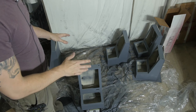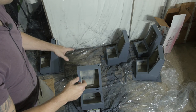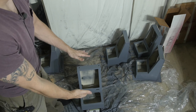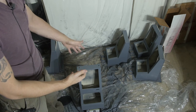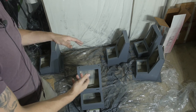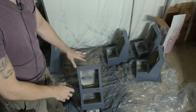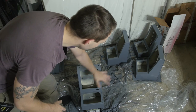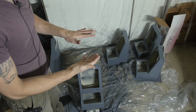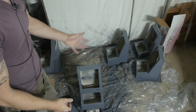And the process that I want to go about doing is basically the same as the primer, except that I think I'm going to start, like we did before, doing this whole midsection, basically the majority of it, and then flip it on its side after about an hour, and then do the top and the bottom. And then when we come back to do the second coat, I'm gonna start on the bottom and the top, and then finish with the midsection. That way, these will be sitting like this during the final coat, because I'm most concerned about this area. The bottom doesn't concern me as much. So if a little bit of the paint peels off the bottom, not a big deal. And I don't really think it's gonna do that because of the way that these dried.